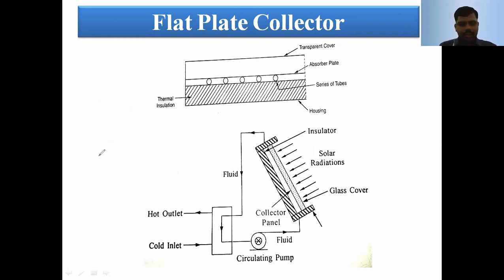But at present, we are using an MPPT controller, that is, the maximum power point tracker. Suppose the solar radiation which is absorbed and converted gives, for example, 80 to 100 volts. We can connect a number of PV panels in series-parallel combination. But in most places, they are connected in series connection. Here they can utilize either 2 PV panels or 8 PV panels based upon the rating capacity.